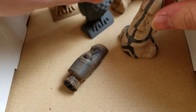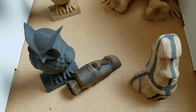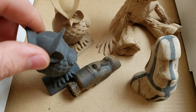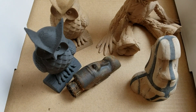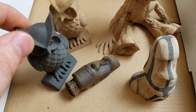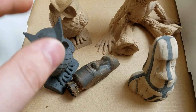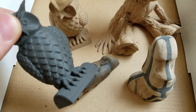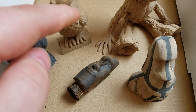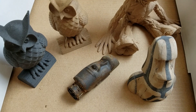These are some cool prints using Hatchbox Wood PLA and Proto-Pasta Iron Fill PLA, all printed on the FlashForge Creator Pro. I did put in some Micro Swiss MK10 hardened nozzle tips, because this stuff is abrasive on your nozzle. So if you're going to buy that stuff, make sure you get a hardened nozzle. The wood fill, however, does not need a hardened nozzle.